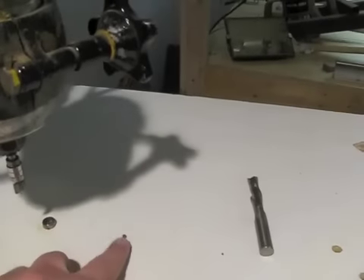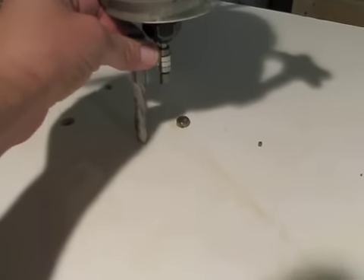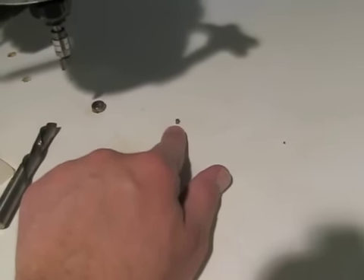I've got my different pins that I use depending on what I'm doing. This is a half inch pin, but I'll use that with a downward spiral bit and I'll do my sides and edges. I've got an eighth inch bit here that I use when I run fretboards — I've got a couple fretboard templates.